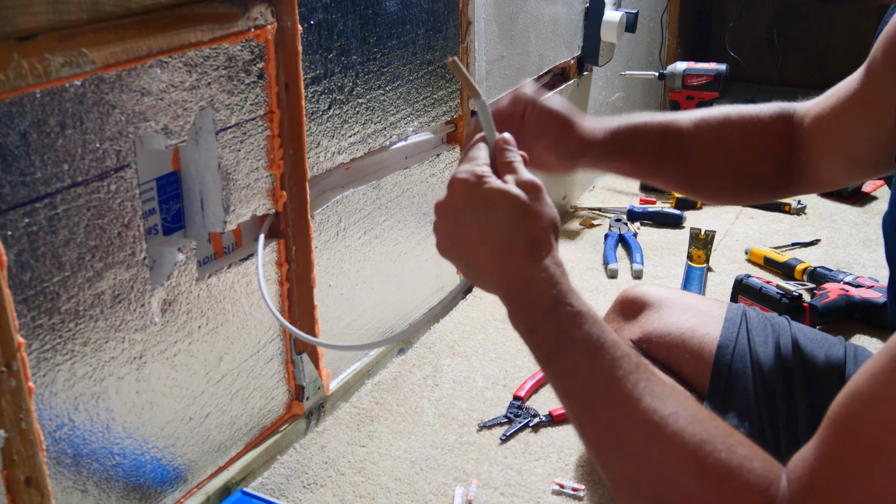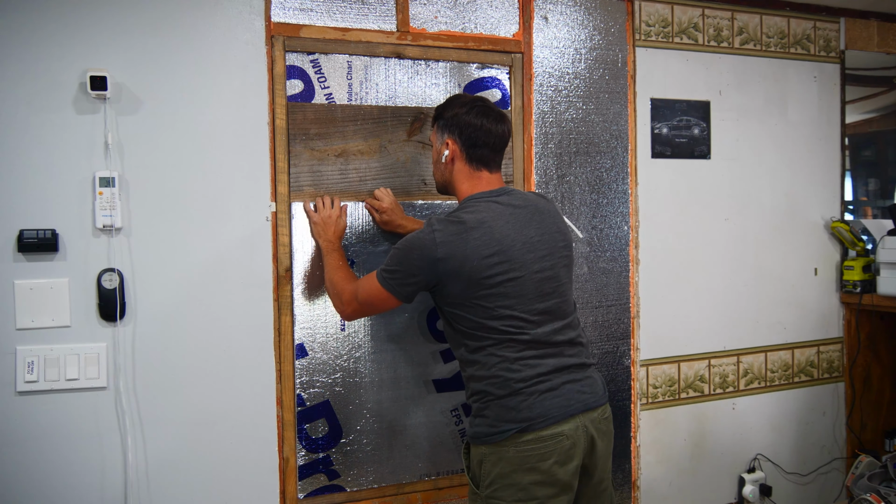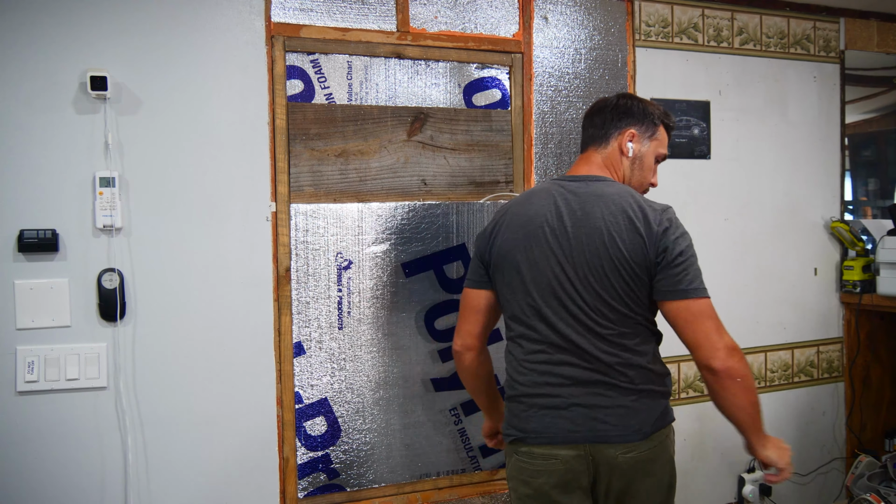As I add in the layers of polystyrene insulation, with the wiring run behind it, I cut out the spot for the box to sit in the insulation, this time cutting the ears the proper way the first time. The reason for the ear design is so that the tabs on the old work boxes I'm using are able to fully open up once behind the drywall.